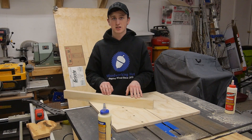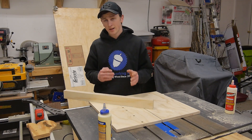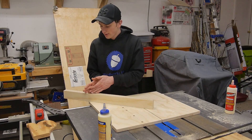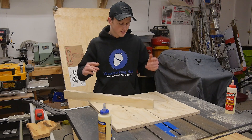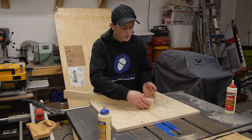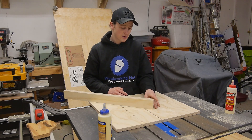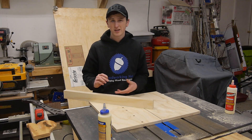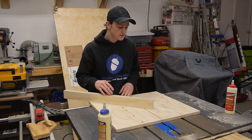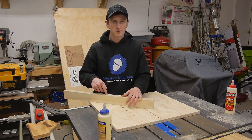It's been about an hour and this is glued in place. I should be able to flip it over and secure it from the bottom side. I did forget to cut this to the rough dimension I want, so I've got to figure out a way to cut off the excess. Make sure that you don't add glue anywhere near the front, otherwise when you go to cut off the extra it's going to be glued down on your table. Go easy on the glue — ultimately it's going to be secured with the screws anyway. Let's go ahead and flip it over and secure this fence in place.